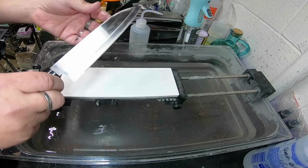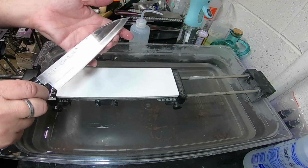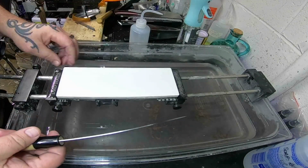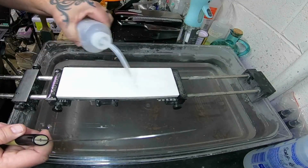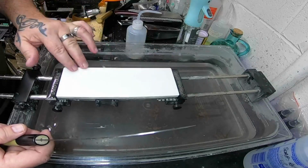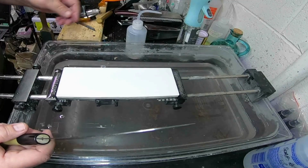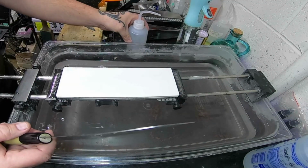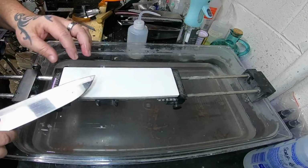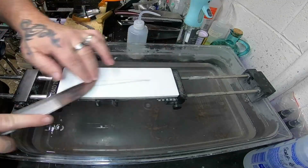I need to pause this for a little station identification here. That is a very significant burr already. That feels good. I may have done a little bit more pressure than normal. I don't know. But still, that's pretty doggone good. Anyway, so the 16,000 grit is different. You'll see that it says CA, and that's calcined alumina. So it's all still obviously ceramics, but it's calcined alumina, which is a little different. So I need to look up what that actually is and what's different about it.